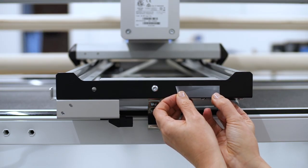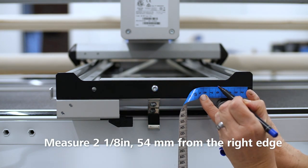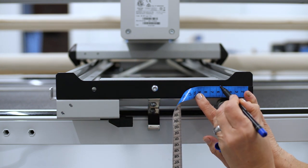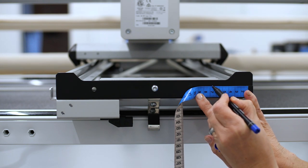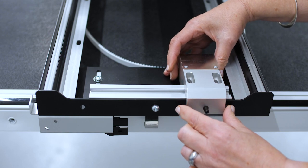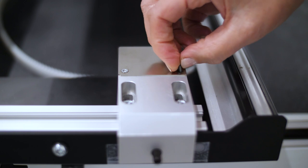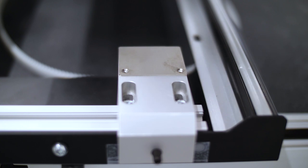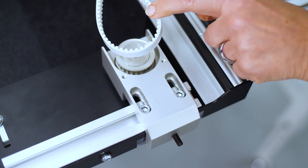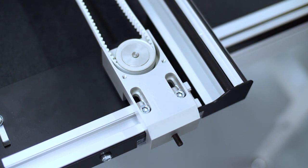First, position a small protective film. Make a mark at 2⅛ inches (54mm) from the right edge of the carriage, and another at 2⅝ inches (67mm). Place the protective film from right to left starting at the 2⅛ inch mark. Position the idler plate flush with the right 2⅝ inch marking and tighten the two screws only so far that the idler plate just about stays in place. Remove the belt cover plate to place the belt inside. Make sure the adjusting screw is loose. Place the wide drive belt around the axis with the tooth side facing inwards and ensure it is not twisted. Reattach the belt cover.